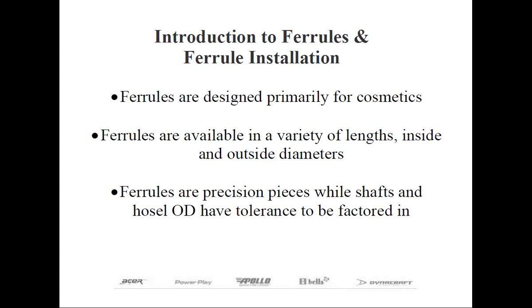This is why we offer two different sized wood ferrules. Otherwise, it's going to require you to remove 0.020 inches from the base of the ferrule just to match the stainless steel fairways. The only exceptions are our tour gear irons, which are die cast zinc and require a much larger hosel diameter for strength purposes — we have a specific ferrule available for that iron, which also works well on older style irons with large hosel ODs. Another example is our Dynacraft Profit ICT fairway woods, which use the same ICT adapter sleeve as the drivers — so you would use the ferrule designed for titanium drivers. This is why it's always helpful to measure the outside diameter of the hosel accurately with your calipers, especially with a club or brand you may not be familiar with. We'll talk about those adapter sleeves a little later.